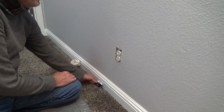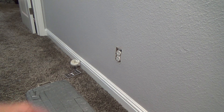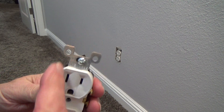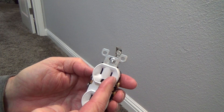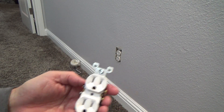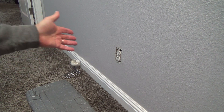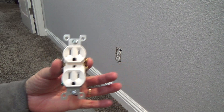That's the first thing you want to do — find the right breaker, test it back and forth, and confirm power is off. Then you want to remove the cover. Now, this is an old-school type of electrical outlet, and I always like to check that out before going to the store. You want to see if it's the round-corner type or the rectangular kind — the rectangular kind costs a little more, about three bucks instead of one. Also, they come in two colors: ivory, which is an off-white yellowish color, and white.